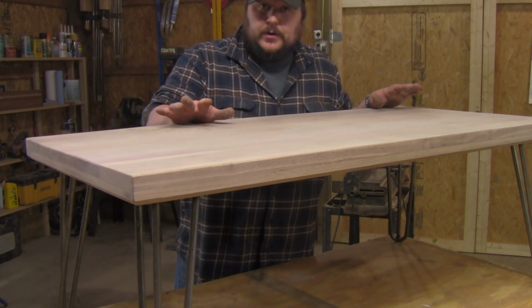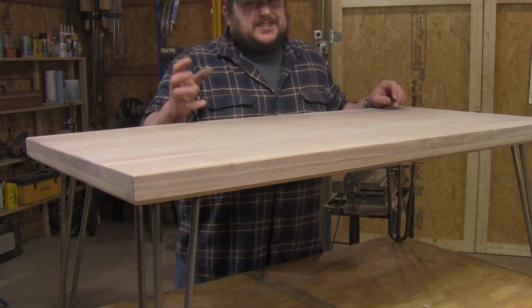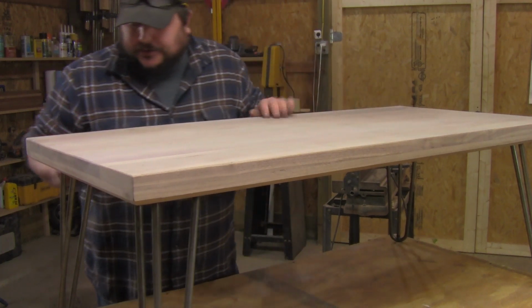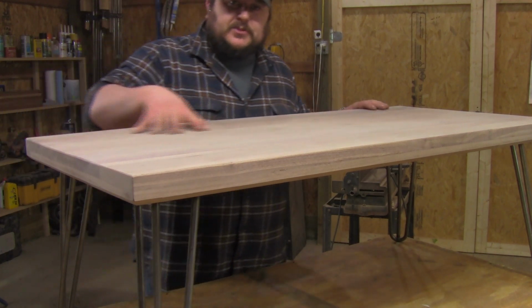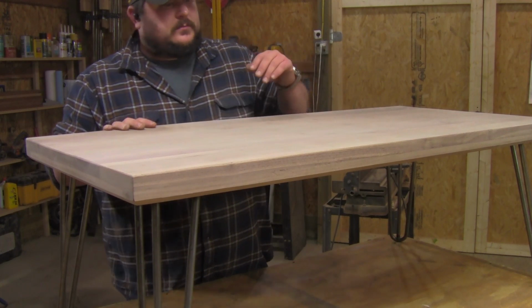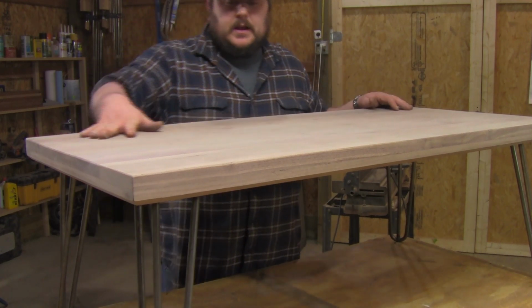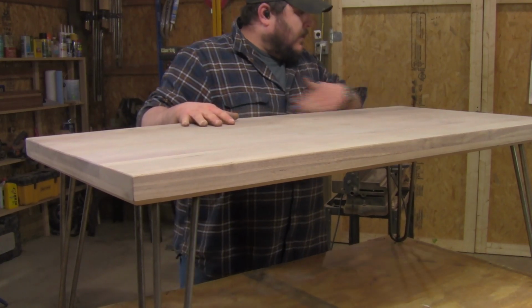I'm going to be using oil, linseed oil. It doesn't actually go whoop, and then you have to try to sand that. That's not a good thing. So I just add a little bit of water to your tabletop. That's what I do after sanding it with your final finish sandpaper. And sand it again. You have a nice smooth finish. So now I'm going to add the oil.